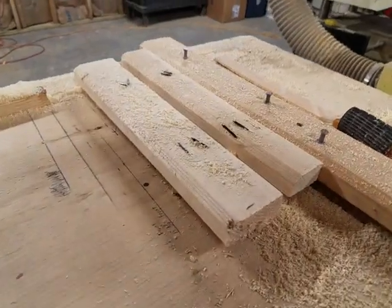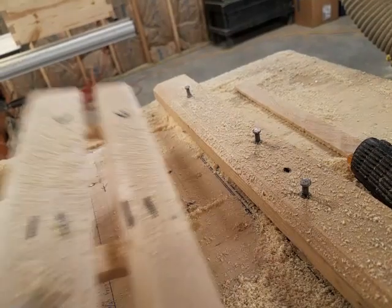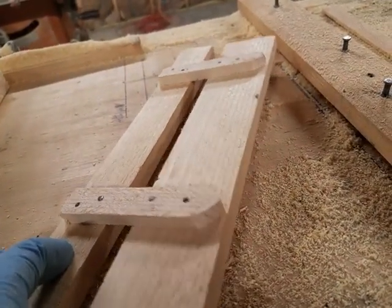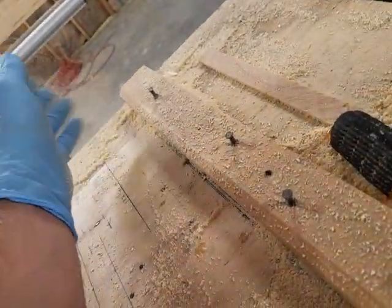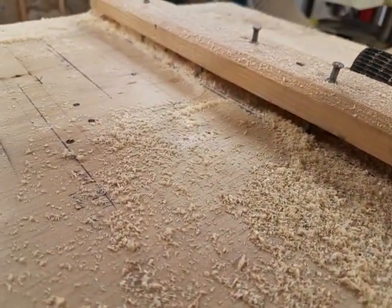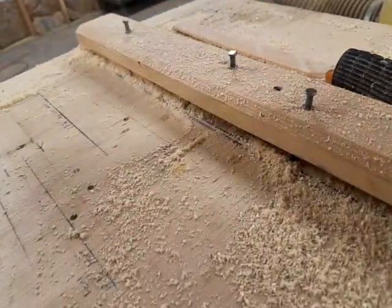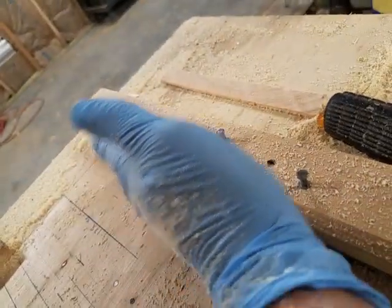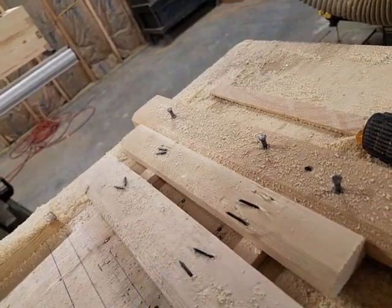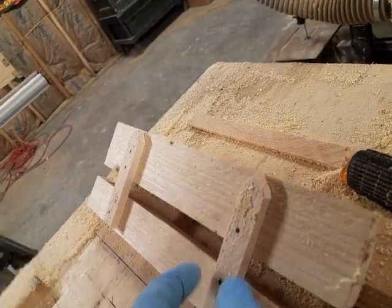You're probably wondering why it's all built up weird — why not just have a single piece of wood? I actually have these little triangle shapes underneath, because in the past sawdust would constantly build up against my board. So the stop is suspended up in the air with a whole bunch of triangles underneath, so as sawdust builds up it just keeps getting pushed underneath and out the backside. The drop-in piece is also elevated so sawdust can go around those triangles and filter down.